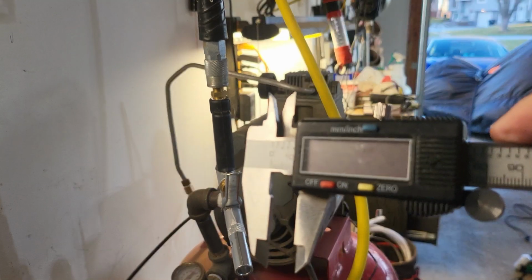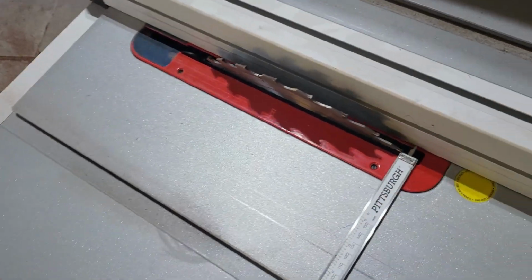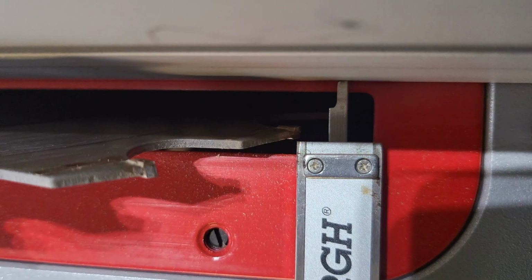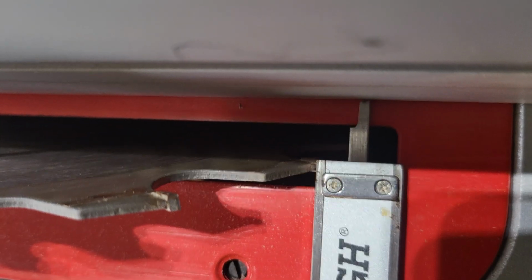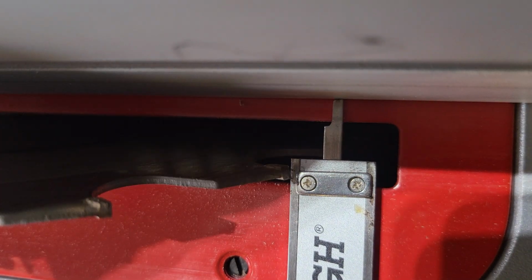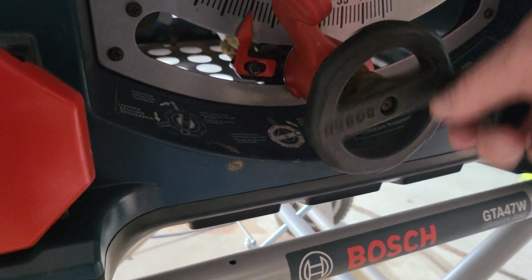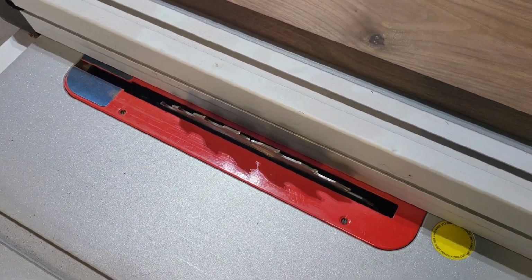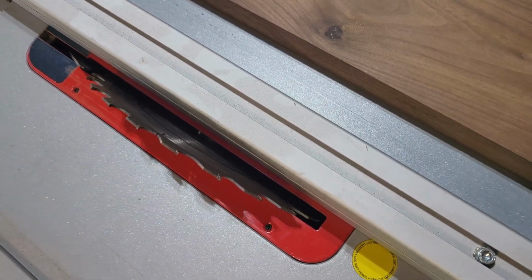So I changed it to 1/2 inch. I figure that's a good round number. Who doesn't like round numbers? So that's why I kind of like using these calipers. Basically, I can really get it in there, get a little more precise. So here I'm just trying to adjust it, knocking it around. You always want to get right to the edge of the saw blade teeth, because that's really the limit there. Raising it all the way up, which is a good thing.